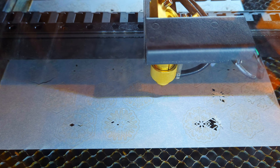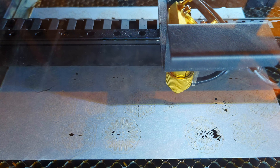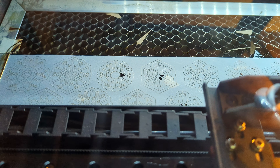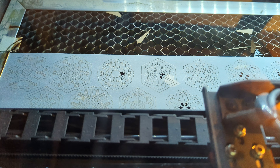So I went with 110 gram thick transparent paper and 250 gram thick blue carton paper. When you cut paper with the laser cutter you want to really fine tune that, because you don't want to have burn marks — you might need to go a bit slower to have very detailed cuts. You can see every little jitter that your machine makes, so be very careful. Better go slower than have jagged lines.